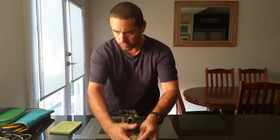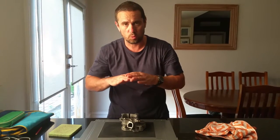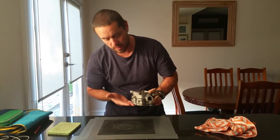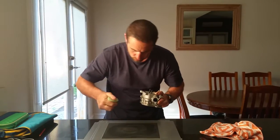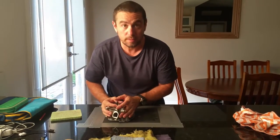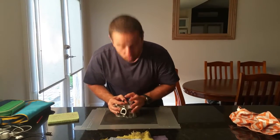I just wanted to show how I'm making sure I apply pressure on the head in a uniform manner so one side doesn't get ground harder than the other. If I just did it in a circle, my stronger right hand would work one part of the head more. So what I do to make sure I'm not favouring any particular side is work in figure eights — down, up, around, up, down, around — trying to be as uniform as possible.